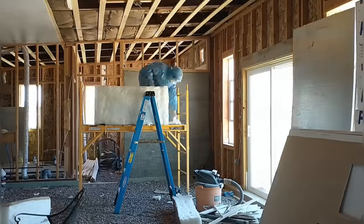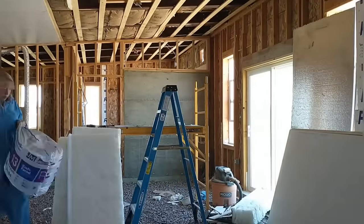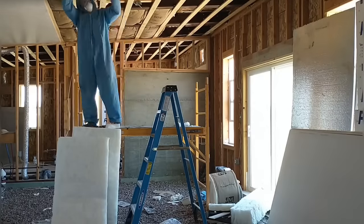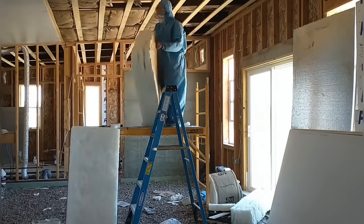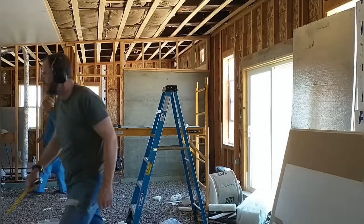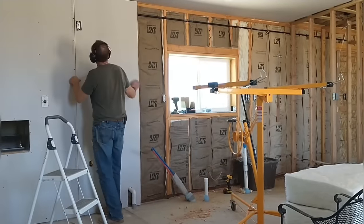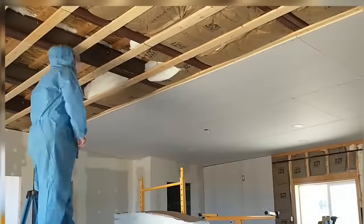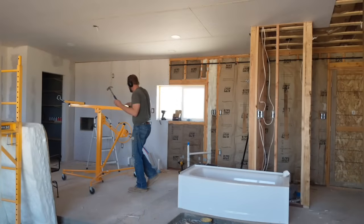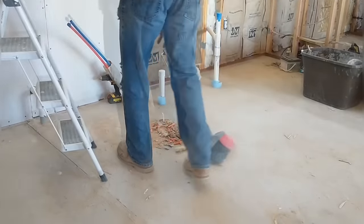You can see I'm working off a stack of drywall leaning up against the side — I really like working with it that way. We had some pieces of insulation providing padding between it and the wall. I bring in four or five pieces with April's help and work those down. It's surprisingly easy to mark and cut when it's in that orientation. This piece has quite a few little detail cuts but it seems to be fitting okay. I still struggle a bit with the outlet box cuts but I feel like I'm getting better.